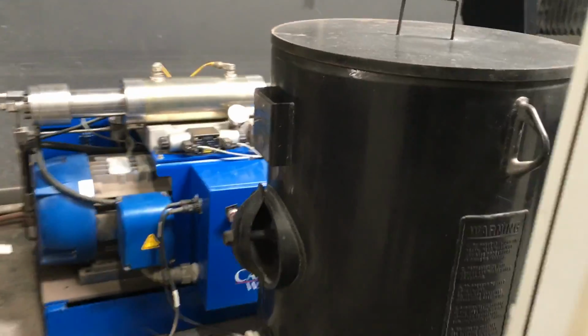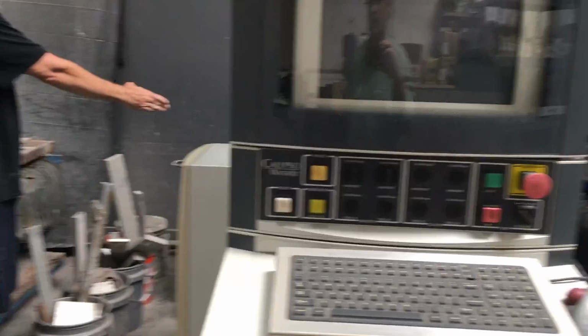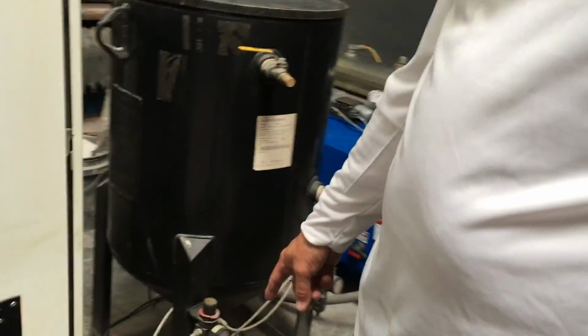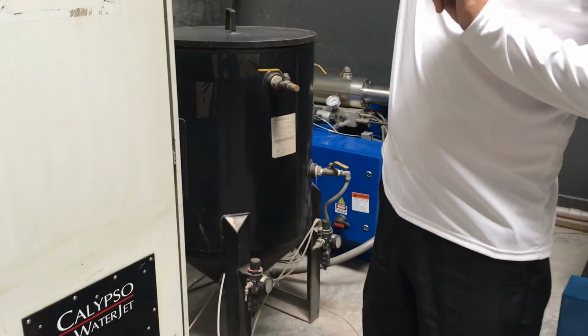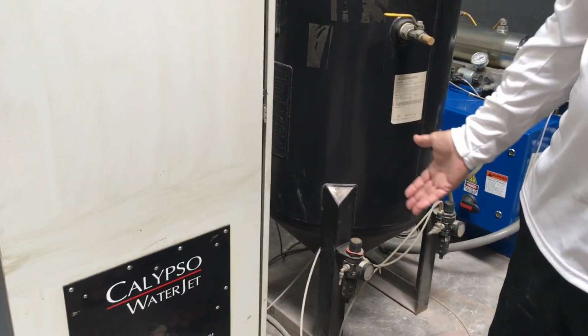That's why I called KMT and said, am I going to have a step-up transformer? I'm 99% sure. They said everything's interchangeable within the box. So can I just plug that in the wall in the 240 like yours, or no? I don't know. Well, something we would definitely want to check. There's the line right there. Yeah, but it says 460. Yeah, but look, there's the end of it. And where would that have gone? That goes into a whole separate plug, separate from just your three-phase dryer plug. Mine's not a massive amount, 230 over there. I've got 240 at the shop. That would run that.